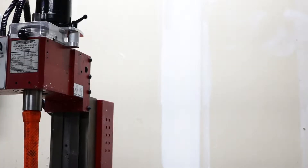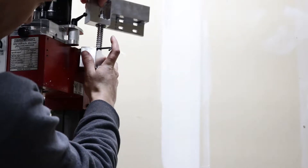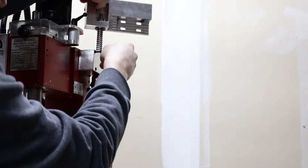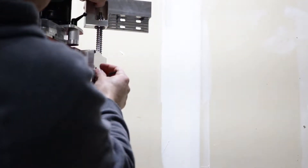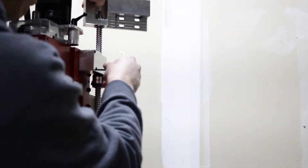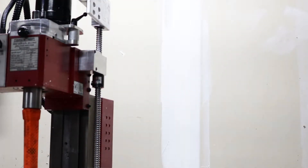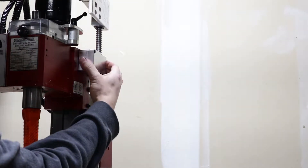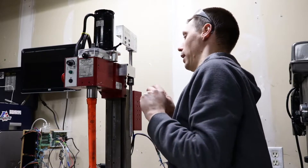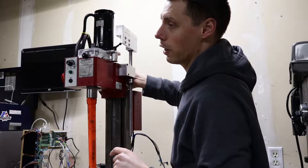Z axis — I'd call that together. Next step is to try and put it on the middle. So the first step I'm going to do is bolt the ball nut bracket onto its little spot right here with the two little screws. I'm just going to snug them — not tight, it can still move. So it's enough to support it but it's still got play in it. This is pretty much all the play that this bracket has with those two screws in it.